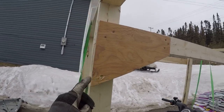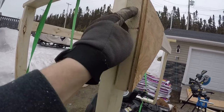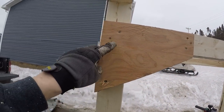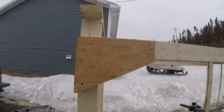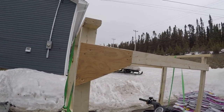And there's the gusset, and you see I put a little filler piece of 2x4 in there to bring it out level with the other piece there, and I'll come back in after I'm finished now and fill in some more screws here for extra strength. But I can guarantee you, once you get one of them on each corner there now, she ain't going anywhere.